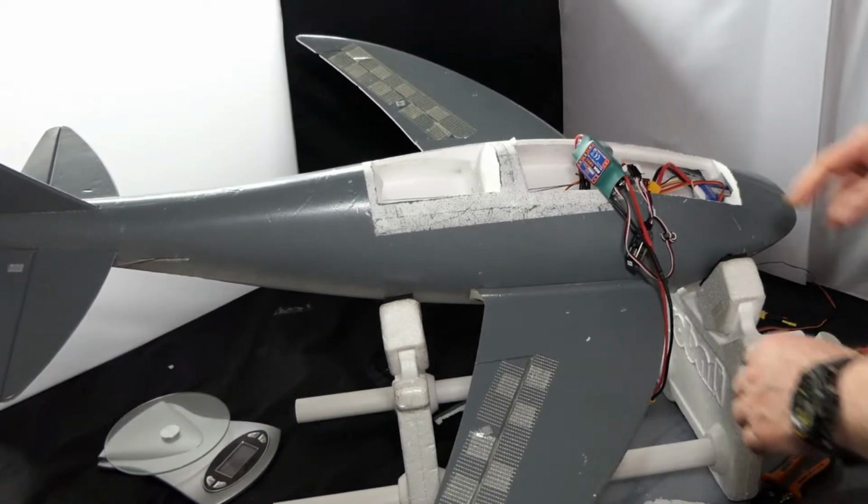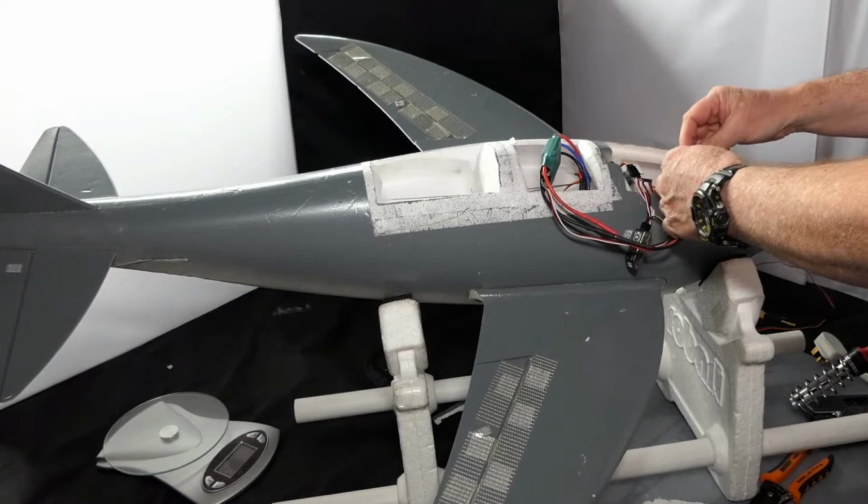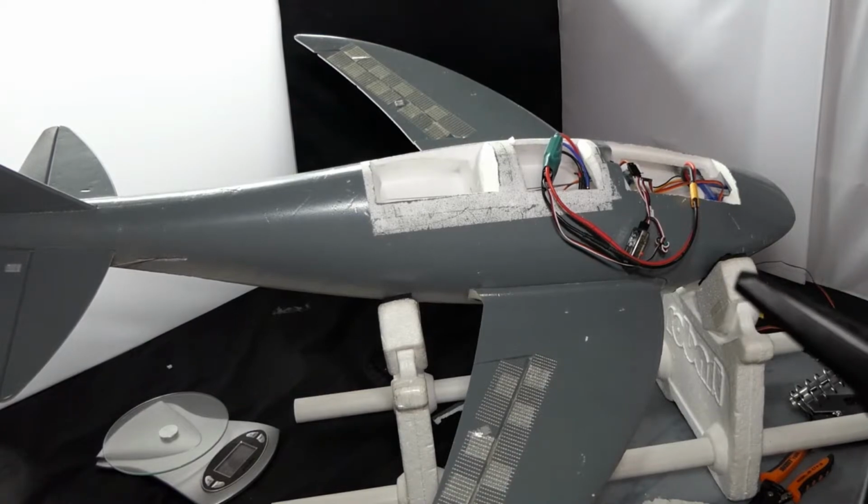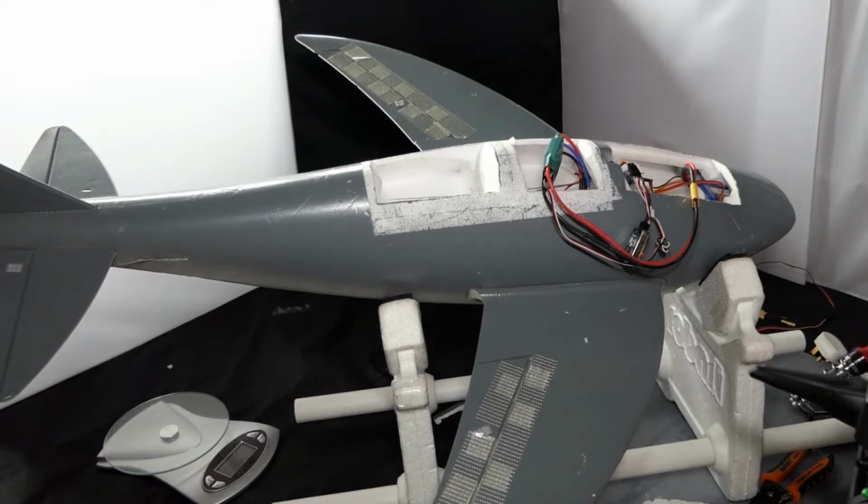I've got my transmitter on. Let's see what happens when we connect now. So there's 3 bleeps, and then that last bleep is something to do with the brake, so I'll have to check to see whether the brake's on and off. So now we've got right, left. High rate. Mid rate. Low rate. High rate. There's no rudder on this, so that's basically it. And then throttle. Sounds as though the brake's on. Yeah, because it stops straight away.